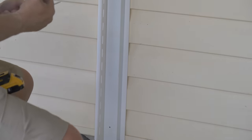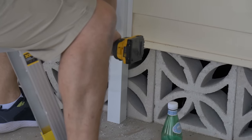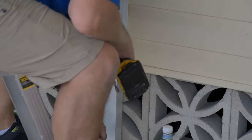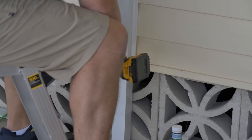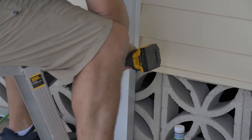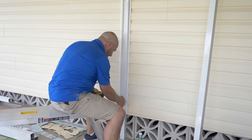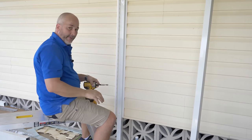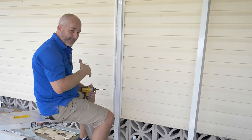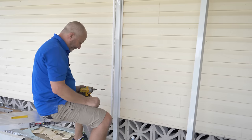Now the metal is 2 inches, the screw is 3. There's a thin aluminum facade. And then in some cases even structure. But the aluminum facade on this building is tightened down with screws every 16 inches. So you can see my metal being concave there under pressure. That's not going anywhere, okay? And for what we're doing, we're just building a facade wall. It's not structural, it's like an interior wall. And that's more than enough.